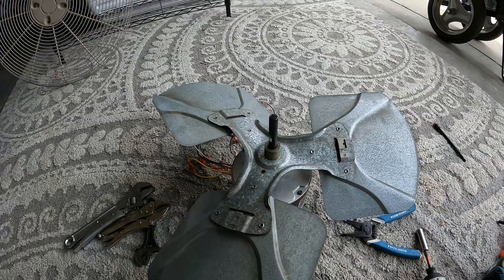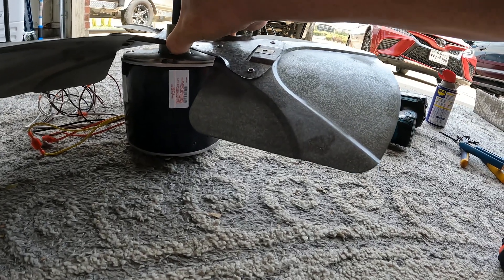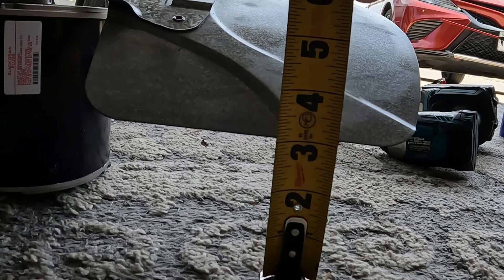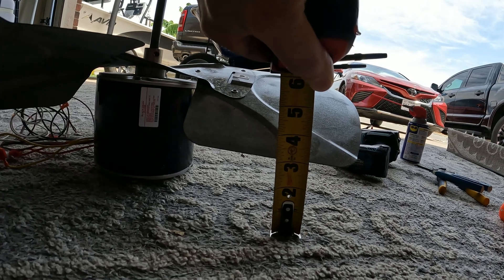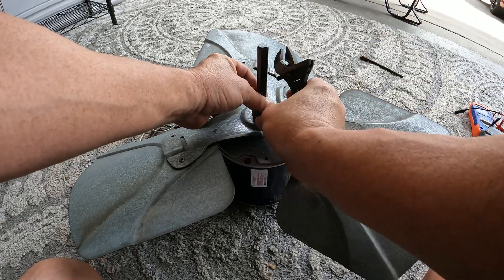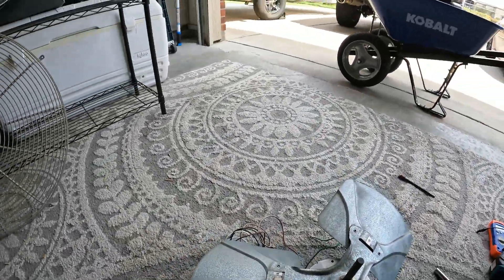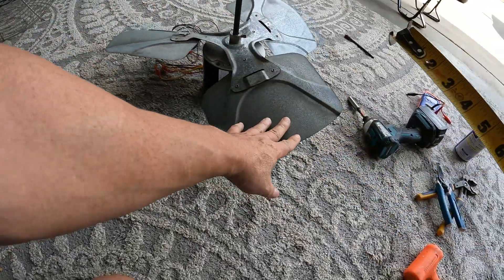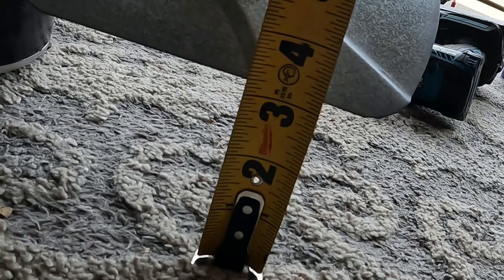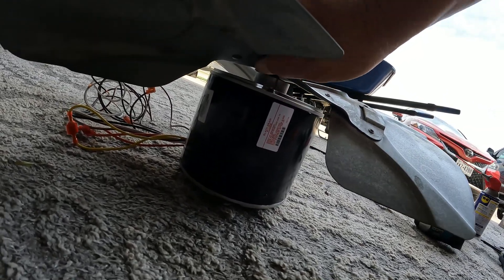It's getting pretty tight on there. All right, once I got past a certain point I've got some play now. She's all the way down on the shaft - right at three inches, so that's exactly where it used to be. We'll probably lift it up maybe a quarter inch and then tighten it. About three and an eighth to three and a quarter should be perfect - a little bit of space there because the shaft has play.